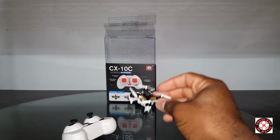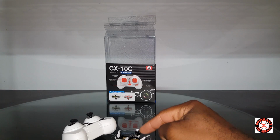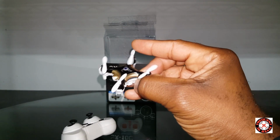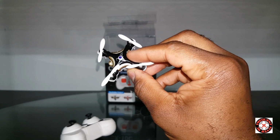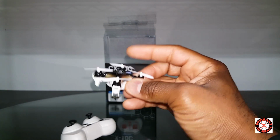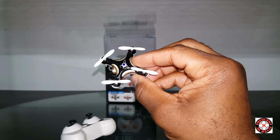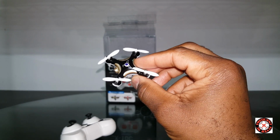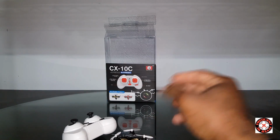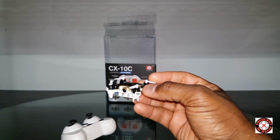And then I noticed that every time I would land, as soon as I cut the motors, this light comes back on. So in essence, I found that the power to the camera was being cut completely during LVC, or when the motor is stressing for power, the power to the camera is cut immediately, completely. And so that's why this light would be off when I landed. And then as soon as I cut the motors, the light comes back on because now there's some power for the camera.